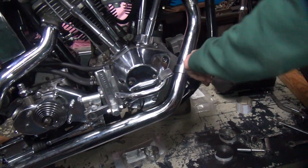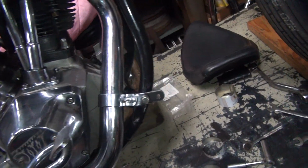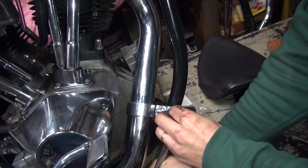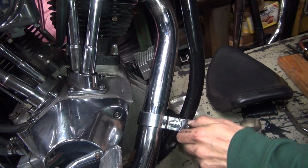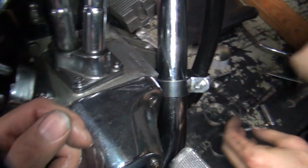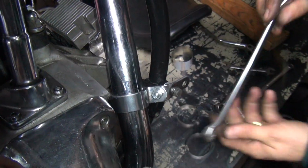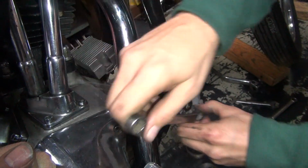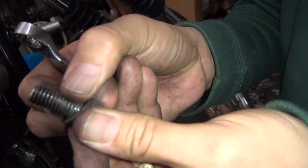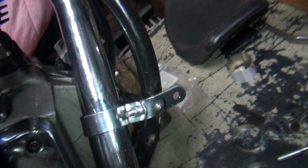Ooh, that spun weird. That means you broke it. Pull it off. And we just stripped it. How many threads are actually going in the frame? 3? There's not many. Well, then you can't torque it with a key-man grip if you only got 3. If you don't see the bolt out the backside, you can't strip them very far. Yeah, so go get another bolt that's 1/4 inch longer. You're pushing it too far on that one.